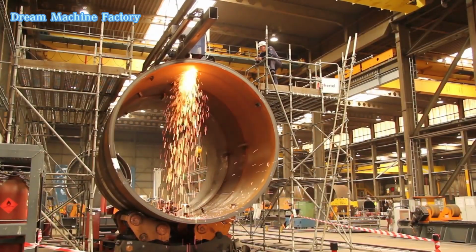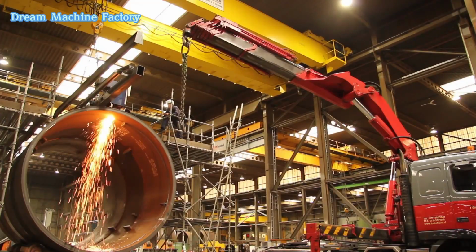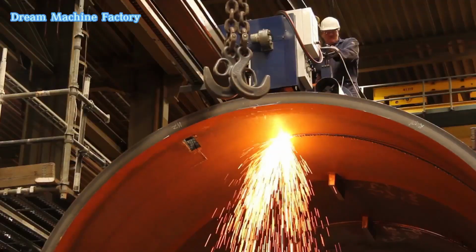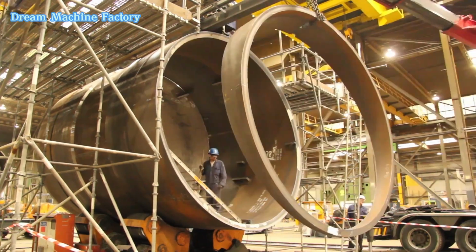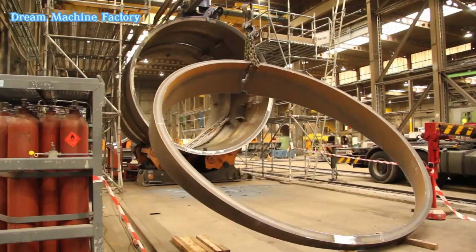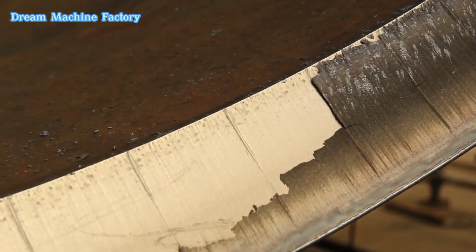Final check. The final check occurs after the dry run and involves a thorough inspection of both the machine setup and the cutting program. The operator reviews all parameters, such as cutting speeds, tool positions, and material sizes, to ensure everything aligns with the provided specifications.